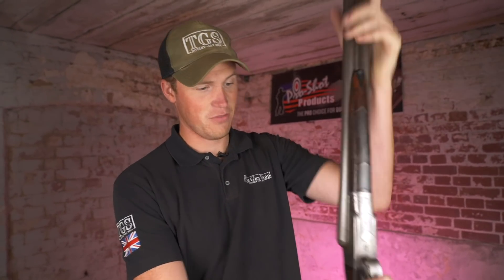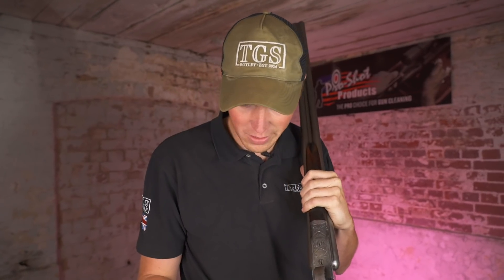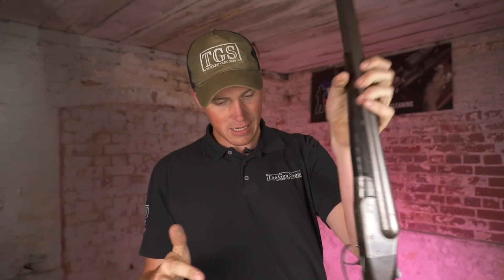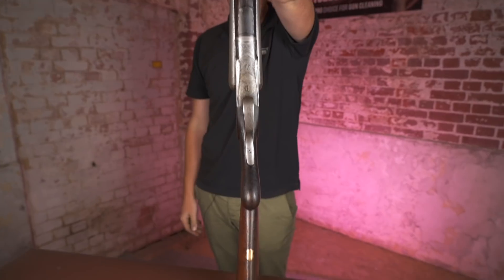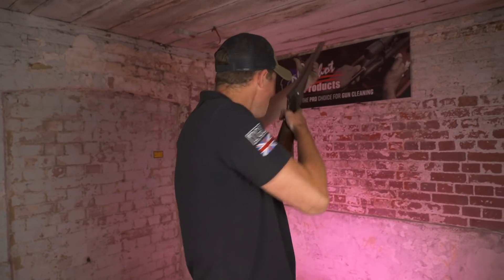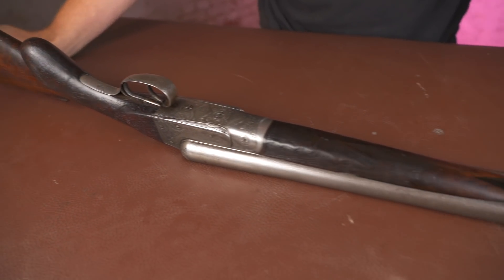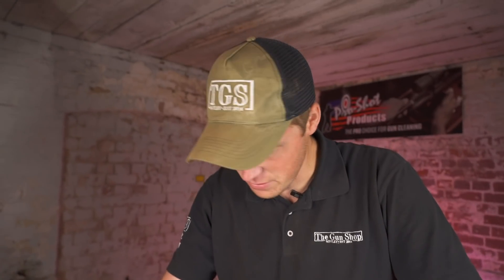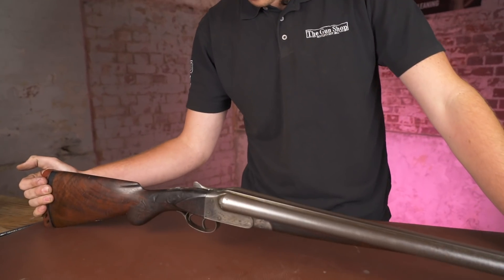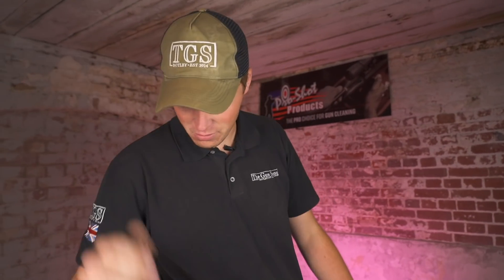Two more observations: these guns were made with about a 14-and-a-quarter-inch stock, so they're actually a little longer than a lot of guns of the era, which is interesting as a factory spec. And look at the cast on this gun — it probably has almost a full inch of cast, which is insane, but it does mean the gun actually comes up all right. This gun is destined to be proofed — mostly because I'd like to shoot it, secondly because I don't mind blowing it up, and thirdly because it's completely worthless without that. There you have it — the Ithaca Krass. Not crass after all. Guys, take care, goodbye. Members, I'll see you for a strip-down.